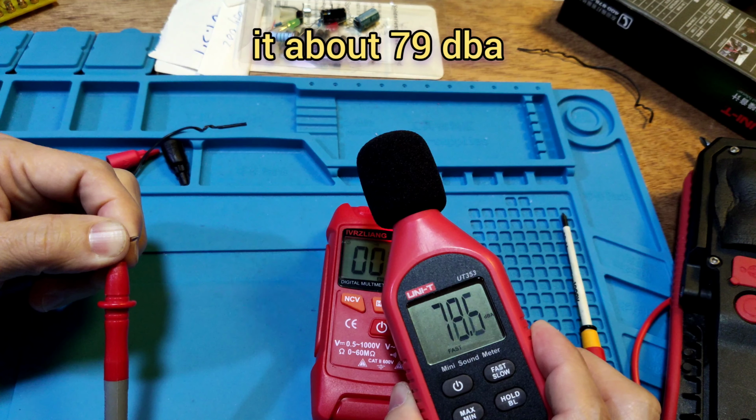Okay. This meter has an auto power off function. When not in use for maybe 15 minutes, it may auto power off. When this logo displays, that means auto power off. When you want to disable the auto power off, first power off the meter. Now power off, and long press the hold key, and press power on. Then the auto power off logo may come out. That may last a long time. Auto power off test.